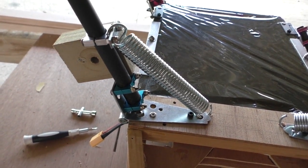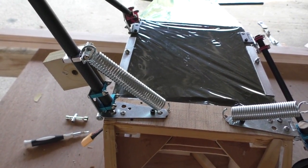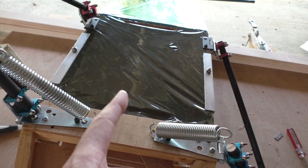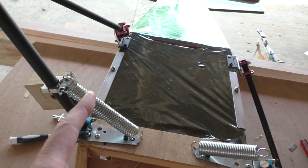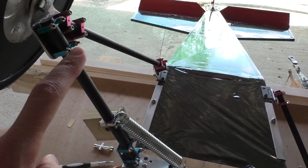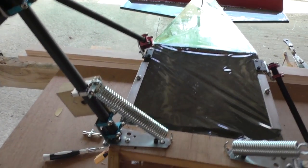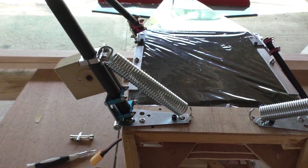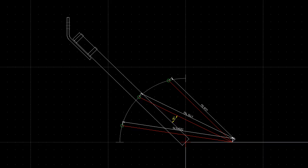But as I do this, I'm starting to realise why this bush plane type suspension is usually arranged the way it is, with an extension or a piece out here to put the other end of the spring on, and this end of the spring closer to here, or not the spring itself, but where the spring will be acting was closer to the wheel itself, instead of the way I've done it. And it's a little bit tricky to explain here, so I'll go inside to the computer and show you what I mean. So here's a little diagram showing the current situation.